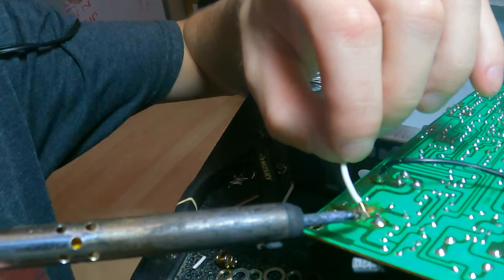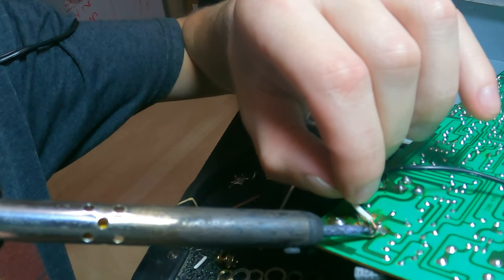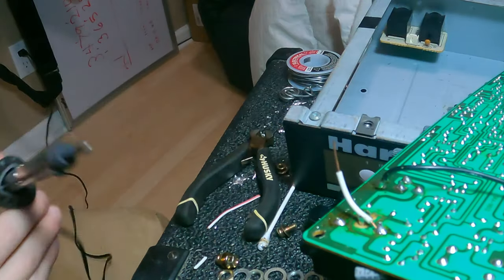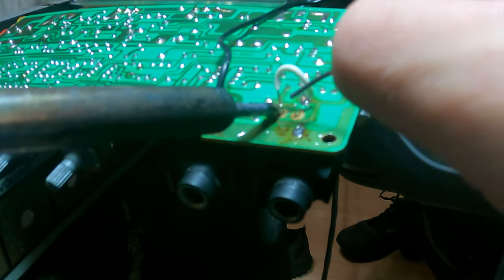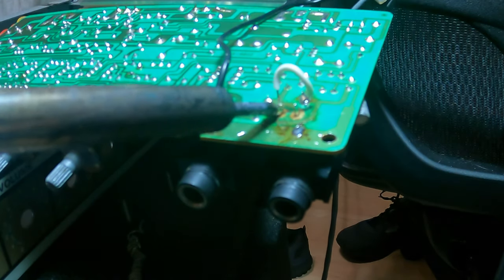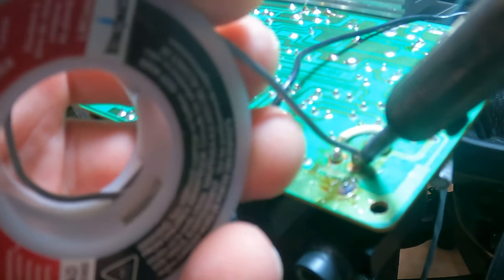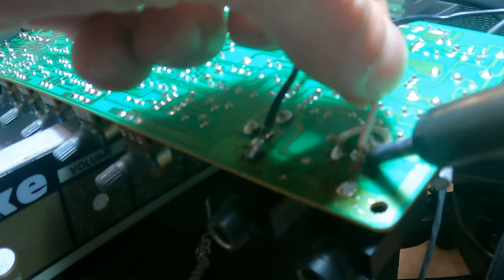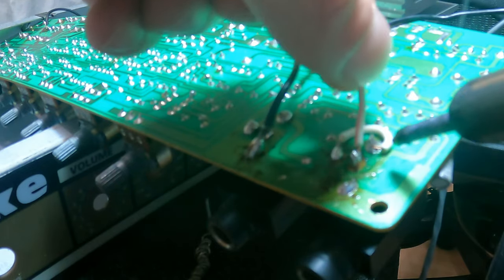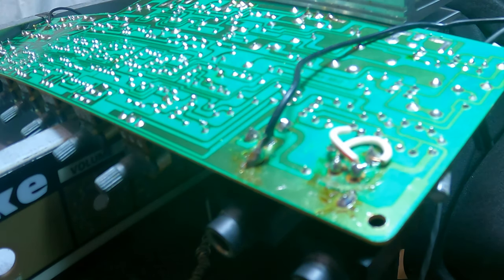Here is my solution: I'm going to use little jumper wires. To determine where these jumper wires need to jump to and from, you need to look at your PCB board. You'll see a bunch of little traces between contacts. What you need to do is trace the contacts of the jack to one other connection on the board that you could solder a jumper to. As you can see, I soldered that top pin of the jack to the leftmost pin of the jack because those two traces connected. Then the middle pin on the right side of this jack, I traced the PCB back to that upper connection up there — that's why I placed that jumper there.